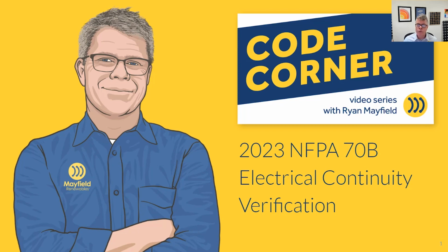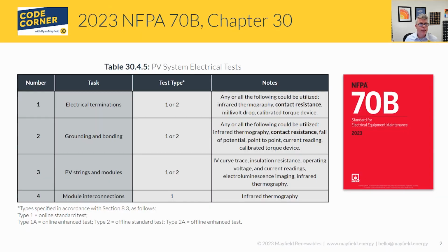And in 2023, they actually added PV systems into the standard. So PV systems had not been in there before. So we have some references now for equipment maintenance in regard to the 70B standard. So we'll jump in and talk about a very specific one, the electrical continuity verification today. We have other videos where we're going to talk about some of the other requirements, but we're going to put a focus on continuity verification today.